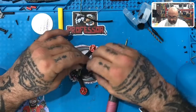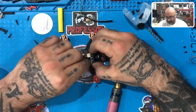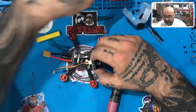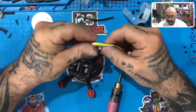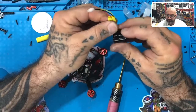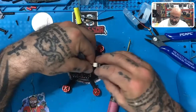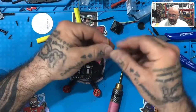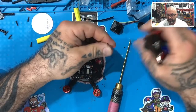The camera is going to sit here. I'll take this cover off because it's going to get in the way. You can see clearly the run of the wire to where it needs to go is very short. I don't want to cut it too short, so let's use the existing length — let's use 30 mil and feed this in, run it down as far as you can. Measure from the camera base and cut it right there. That's going to be plenty of wire.